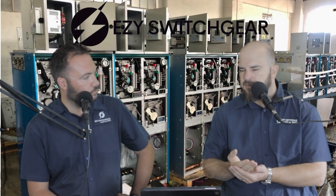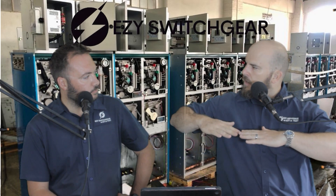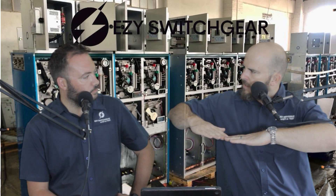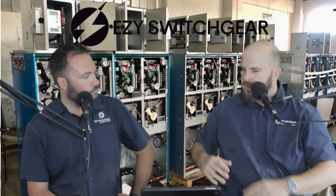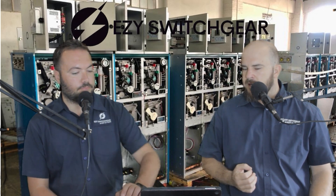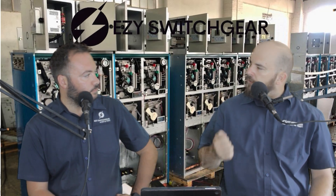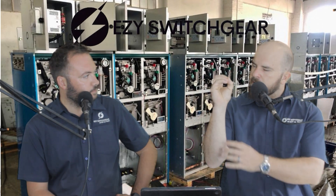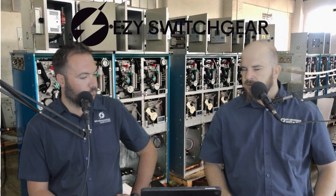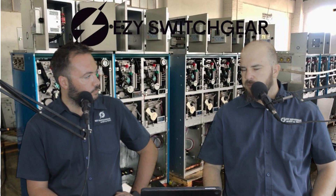You will also check your interlocks. A lot of these interlocks are very based on where the unit is sitting on the floor. If your floor has a little bit of an elevation or instability, it will affect your interlocks, so it's important to check that. Then your functional test, and then you check for gas leaks again — especially after you've done your cable connections, because the cables can hang on your bushings and that creates leaks. A gas leak test for secondary switchgear, especially gas-insulated switchgear, is super important.